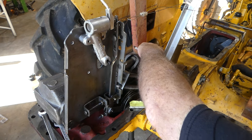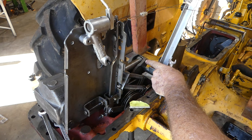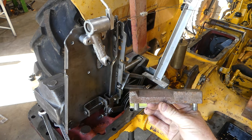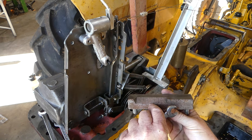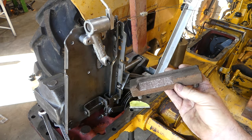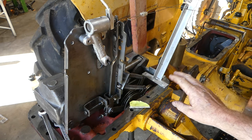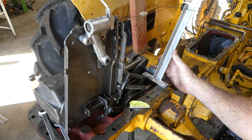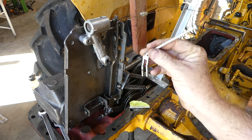I have the tool in the back there to hold the bell crank that holds the donkey dick back. Here is a homemade one I bought with some gear one time — all they've done is pick up the holes there, about half an inch, inch and an eighth by inch or something like that, so you can make that. All that does is make sure that the hydraulics cancel out before this rod, this bell crank, hits the back housing hard.